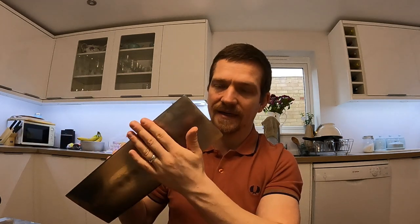Back in the day, you'd have two trowels. You'd have one that you'd take rendering with you — the one you'd take rendering is the one you're breaking in, as it were. The render, the sand cement, does a real good job at fine-sanding the edge of your blade. Then you'd have your other trowel, which you'd use daily — that's your finishing trowel. You'd always have a backup that you'd break in beforehand. These trowels are not good for finishing straight off the bat — they're not ready for it.